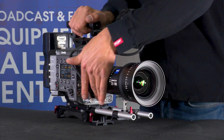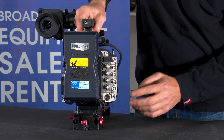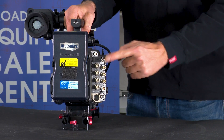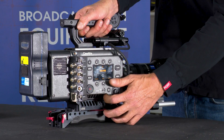There's a Fisher 11 for the viewfinder — not the 3M plug that was in the previous models. There's also a standard Hi-Rose 12-volt output as you would normally get in a Sony camera, as well as a 4-pin 12-volt XLR and a 5-pin XLR for audio.